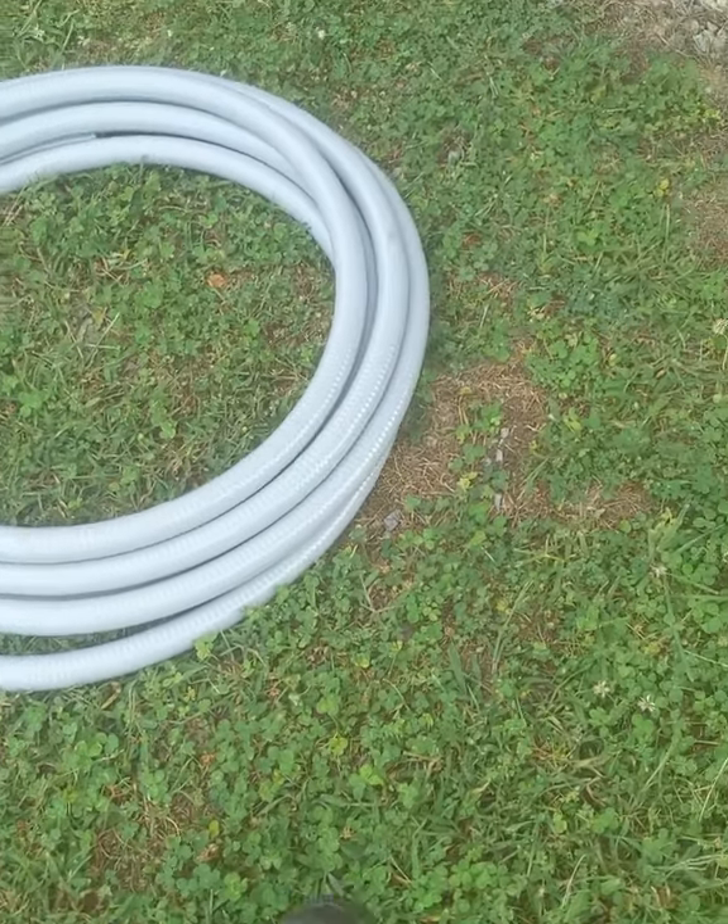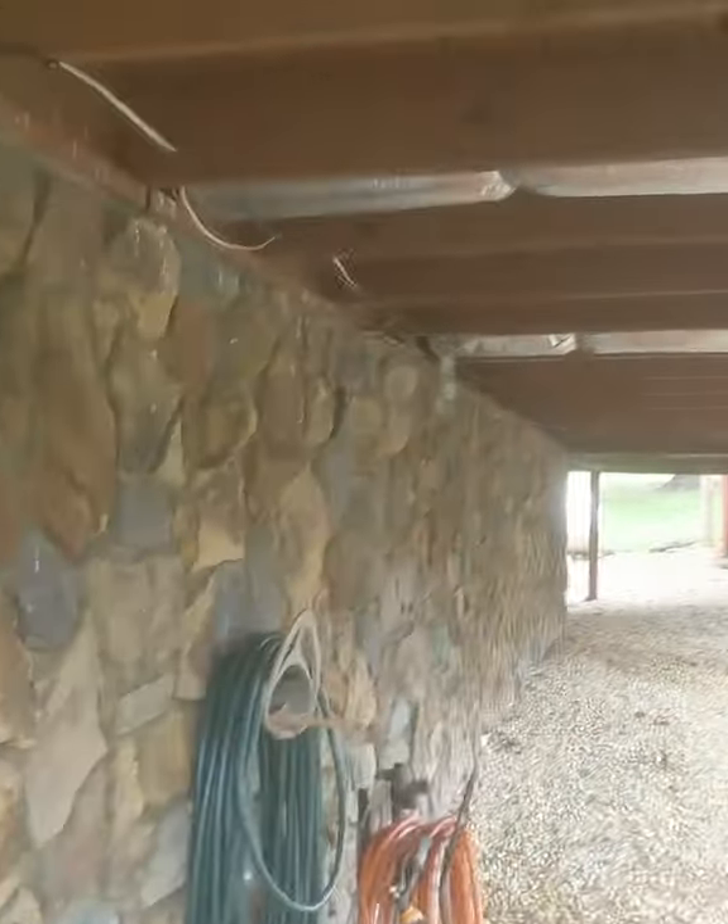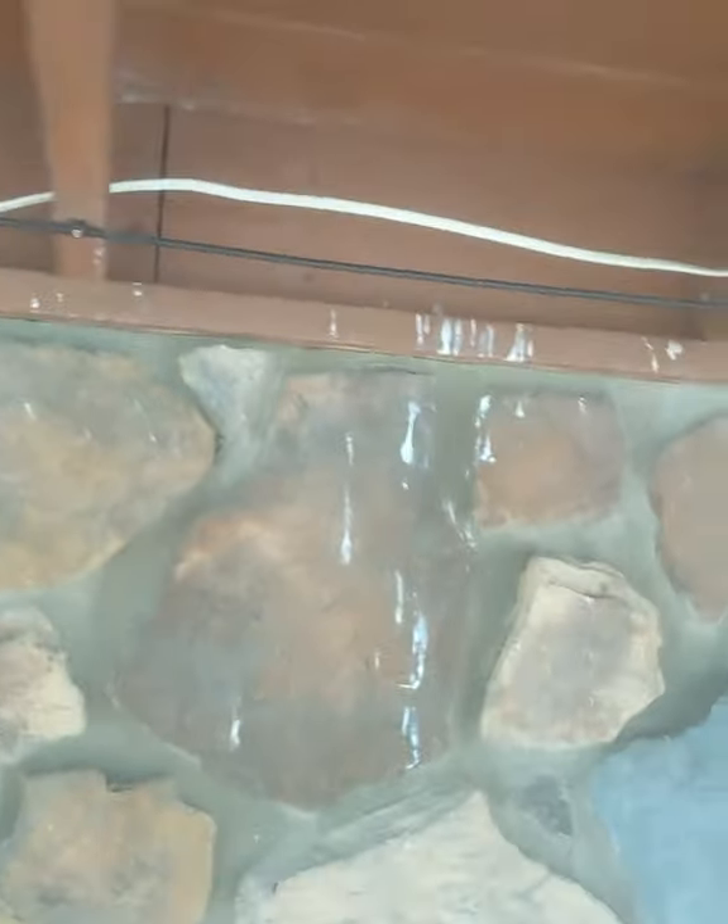We're going to take this one-inch carflex and pop out of our hole here. We're going to junction — transitioning from Romex to THHN/THWN. We're going to run to the bottom of these joists, strap the conduit nice and straight, and then pull the wire through.